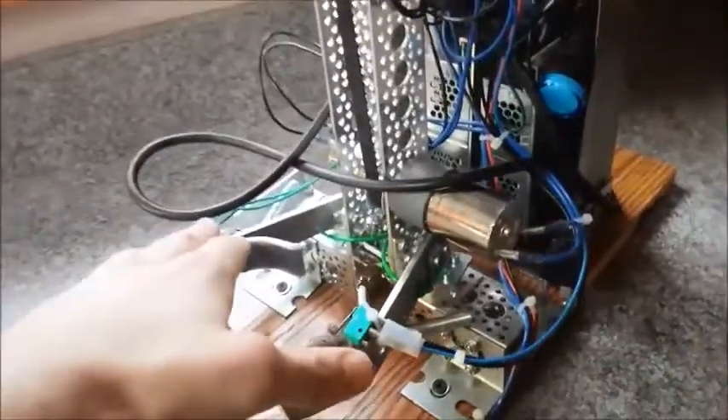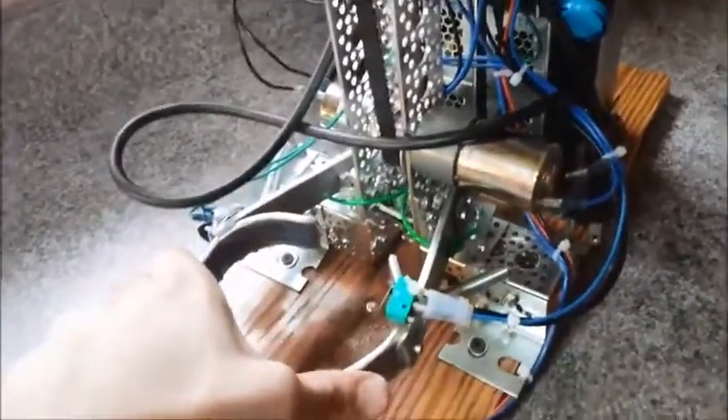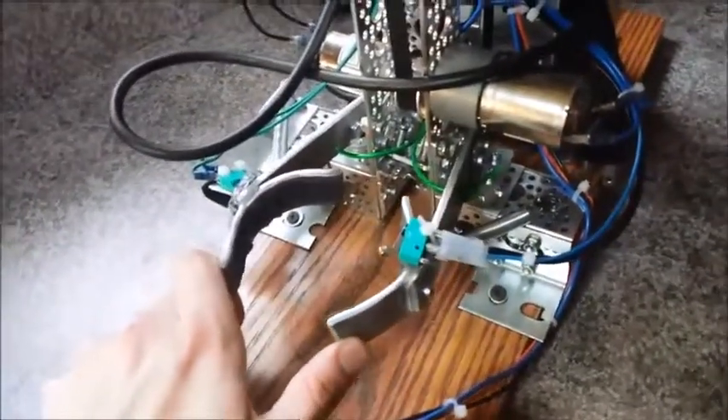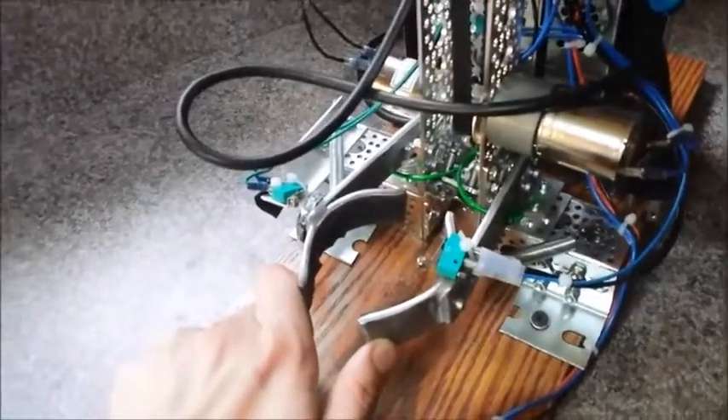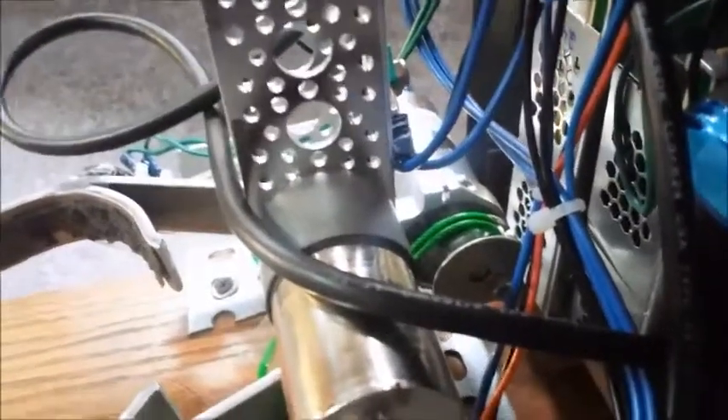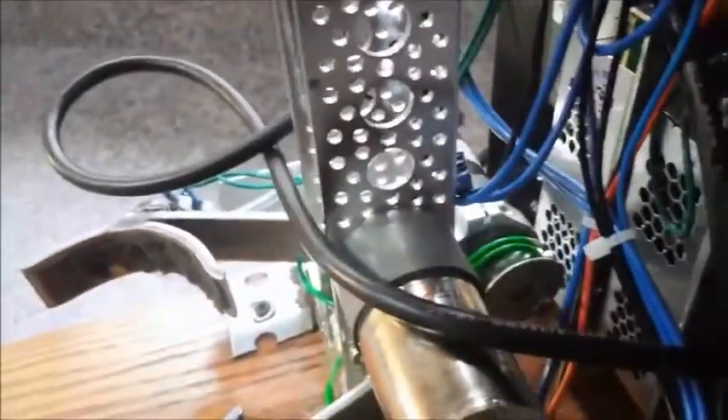A linear actuator or some sort of worm gear acting directly upon the inside two arms of the graspers would better grasp the bottle and apply more torque with less damage to the motor. The gearbox and the grasper motor burnt out twice from being over-torqued.